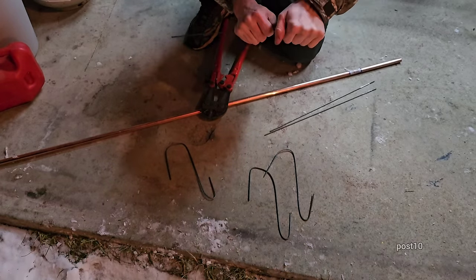Could have been worse, but that's going to have to be repaired. You can see it's buckled between where the studs are. Stud here and stud there. It's buckled a little. Ripped a few shingles off. Yeah, the trim up there, if we zoom in, is visually broken a little. Let's see how bad the roof is. Yeah, that roof is going to have to be repaired right there. That's going to let water in, actually.